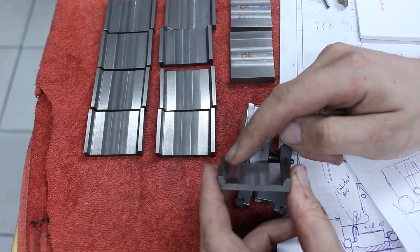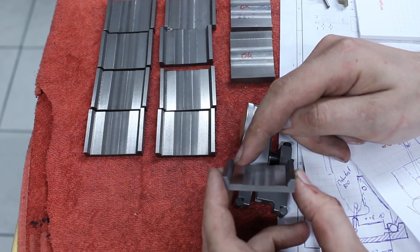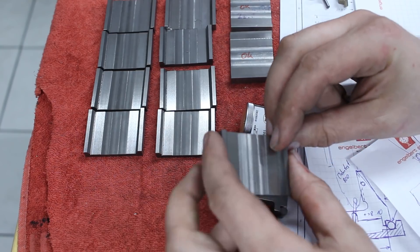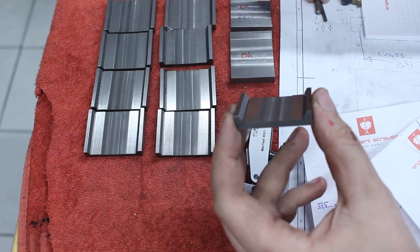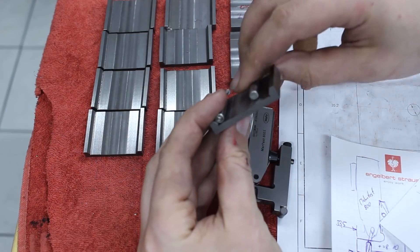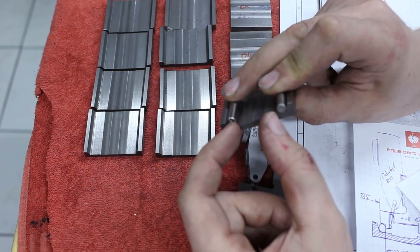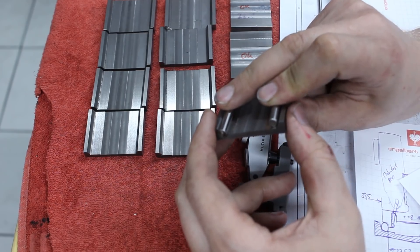I'm making a bunch of these prismatic blocks. This prismatic cutout has to match the bed of a watchmaker's lathe very precisely, so the scraping to final matchup by bluing and spotting goes fast. The problem is this is dimensioned over pins. Normally you would take two pins, put a clamp on top so they don't move around, and then put gauge blocks in between to get your actual dimension. But that's a lot of parts — you need the two pins, something to hold them in place, and the gauge blocks.